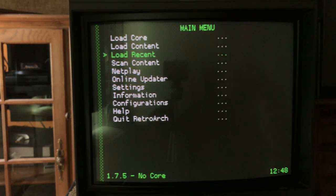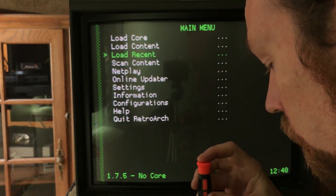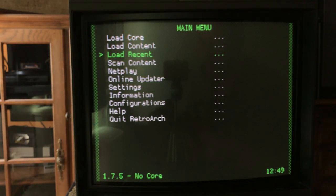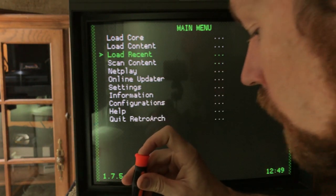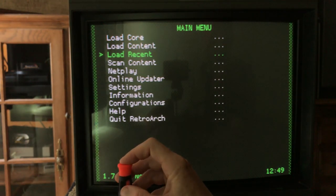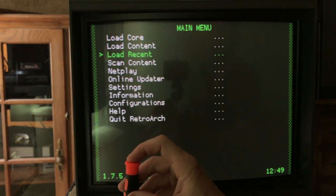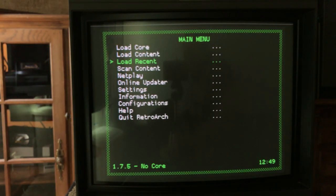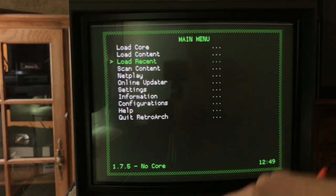The horizontal center is obviously off, so we're going to turn that one — it's a Phillips screwdriver, so we get that in there and let's center it. Okay, that's centered now. It looks like vertical height is too much. I'm in 16-by-9 mode. It has different pots for 16-by-9 versus under scan — under scan is what we want to see, that full green border.